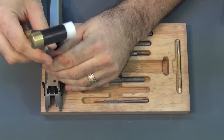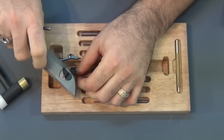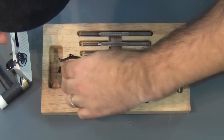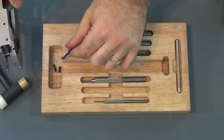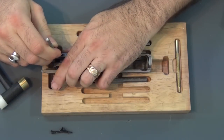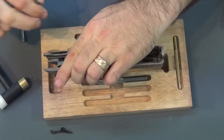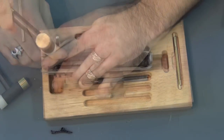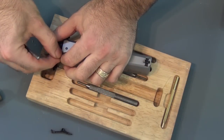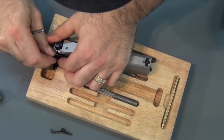Tonight I'm going to install that new safety and make this a Type G. First thing I'm going to do is take out the extractor. There are two little springs underneath it — they come right out — two little springs, one inside the other, and a little pin. I don't want to lose any of that stuff, that's why I do it over this little tray right here so everything stays in there. Next I've got to do the same thing to a little pin right inside the side safety. There's a little pin that holds it on and I'll just need to pound that out. Once that little pin is out, you've got to be careful taking this off because there is a little spring under there.